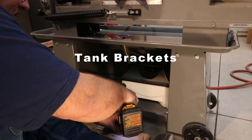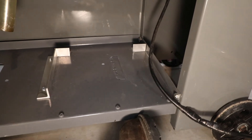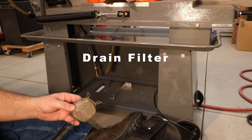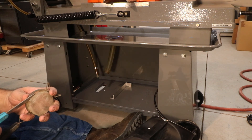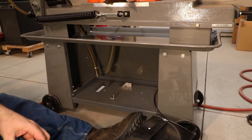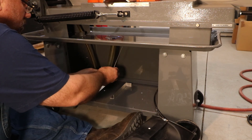To keep the coolant tank secured, I used some pieces of one inch aluminum angle, which I pre-drilled and secured with self-tapping metal screws. For the oil drain tube filter, I used an antique kitchen strainer. I cut the mesh from the bottom and fastened it to the bottom of the drain tube with a zip tie, then cut away all the excess. I'm not sure if that's going to be the right gauge of mesh — only time will tell. I could go a couple sizes larger, but we'll see how this one works out.